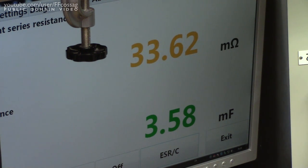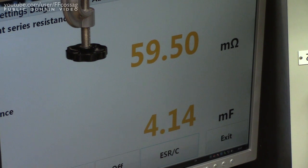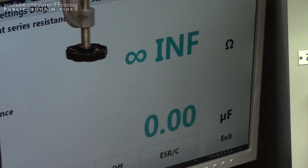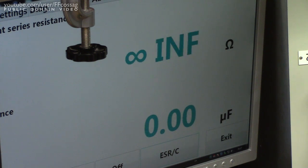33mΩ on those — that's fine. That's probably the 12 volt output, or the 5 volt output, or 3.3 either way. A 2200µF 6.3 volt cap reads 60mΩ — a bit higher than I'd like to see in a cap like that, but it's fine, it's not failed yet. This is clearly another cap on the same rail, similar impedance. Under 100mΩ in general is fine in a thing like this.